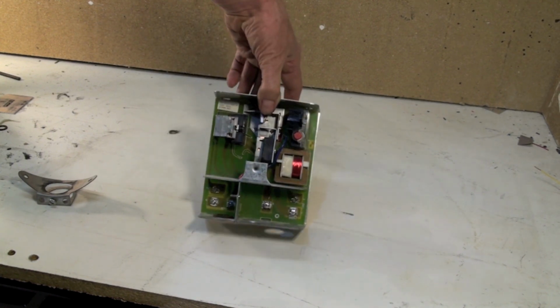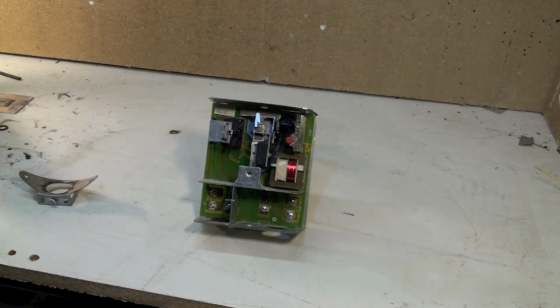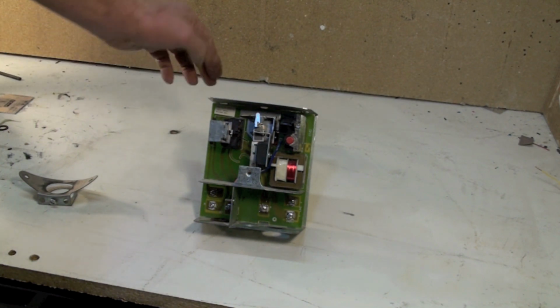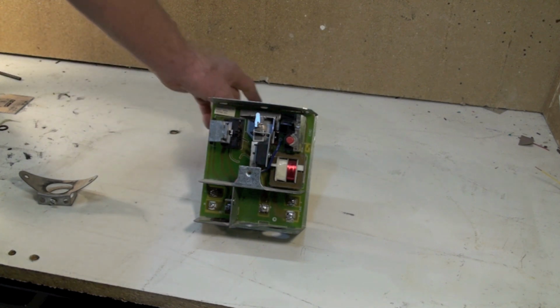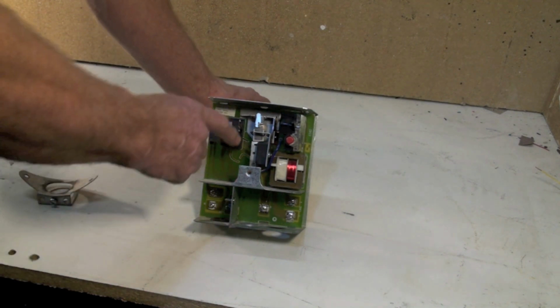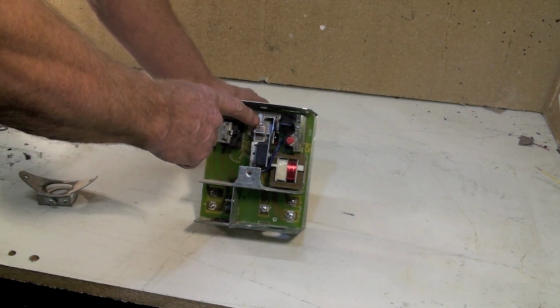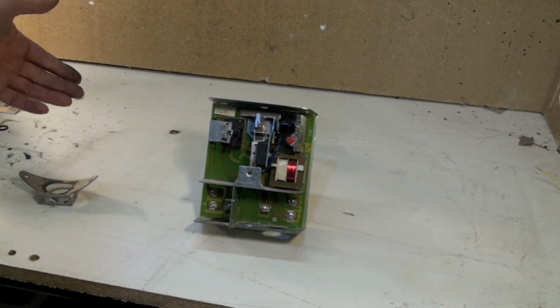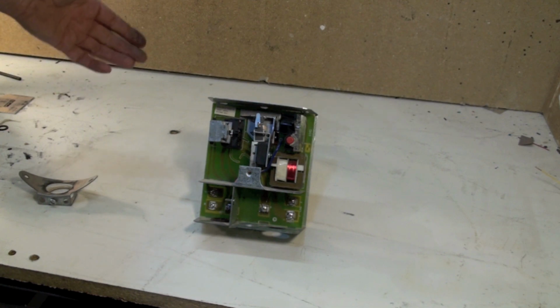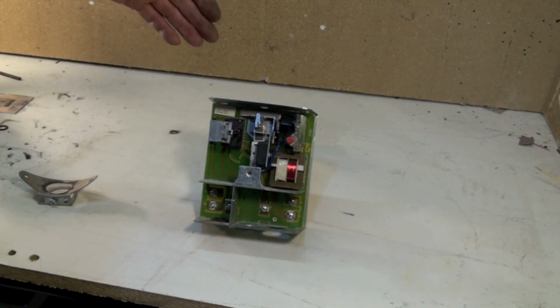There is one caution when you do that. You will probably do what's called knocking it out of step. That means the bimetal hasn't come back to its original position. Remember I said it had to be cold? So it had to come back to its original position. You can see that little lever right there that moves with it. When that gets out to the original cold position, then it will allow it to light. If it's part way down, it won't.